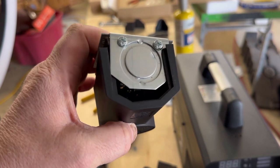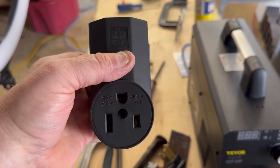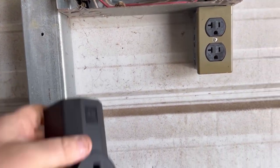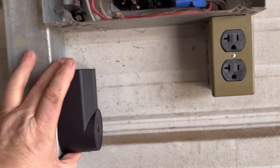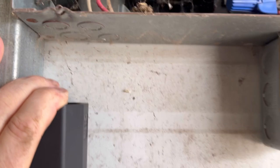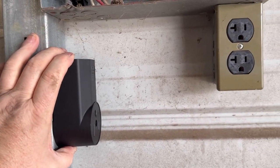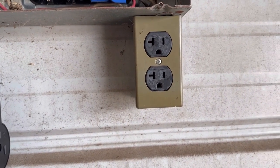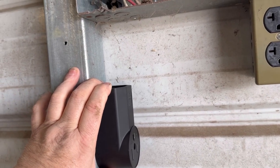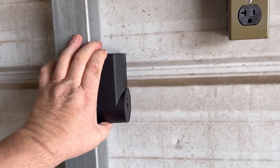It's got a knockout for your wire. I've got a couple of conduit clips — we'll get this mounted and get our wire ran. I'm deciding whether to mount it on the pole right next to the breaker box for only about an eight-inch run of wire, or mount it on the inside of the pole. Going straight to the bottom of my box for the knockout and running my wiring will keep it out of the way. I'm going to mount it right there, just below the heavy-duty 20-amp 110 receptacle.